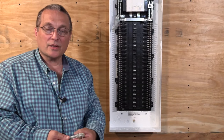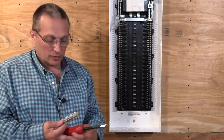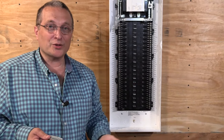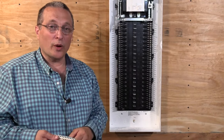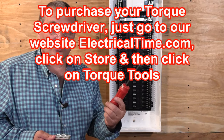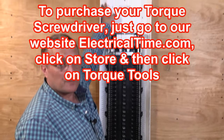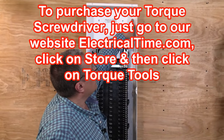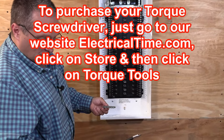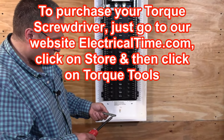Right now we're going to be installing some additional ground bars. It's important — and the National Electrical Code tells us about this — to use a torquing screwdriver. If you look at the instructions that come in the package, it's going to tell you what size screw and where you need to set your torquing screwdriver to. I'm going to install three of these: one ground bar up here, one over here, and one down here. I have my torquing screwdriver set to the manufacturer's instructions.